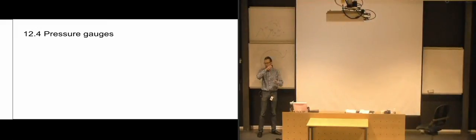What that does is that once the Bourdon tube starts moving from the pressure, it's going to have some resistance from the fluid, because it has to push against the glycol that's inside the pressure gauge. This means that it won't be able to move as fast. So instead of vibrating very quickly back and forth, it's going to move more slowly back and forth, because it has to push against this glycol, which, as he said, makes it last a lot longer, because you don't have that much wear and tear on it. And you can see quite a lot of metal parts in there.